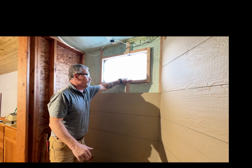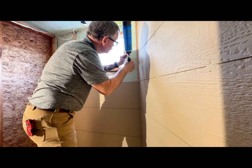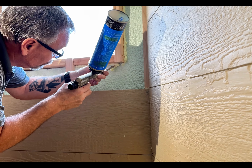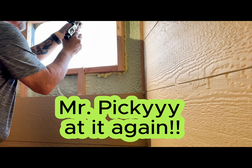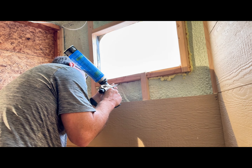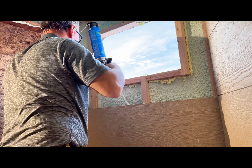We're going to foam this in, and then we'll show you the window after we get it installed. You can see I'm filling all these little gaps — we like to always do this to stop any transfer of temperature, keeping the integrity of the insulation seal around everything. This is a square opening and our window has curved corners, so once we install the window I will also go back in around the window itself and foam in there as well to fill in those corners so we don't have an air gap. Just trying to keep the integrity of the insulation intact on every aspect.